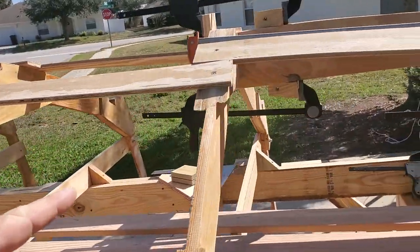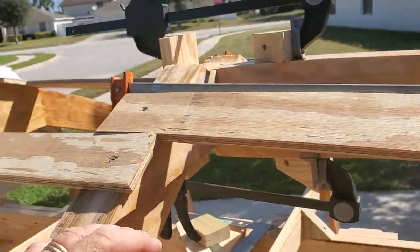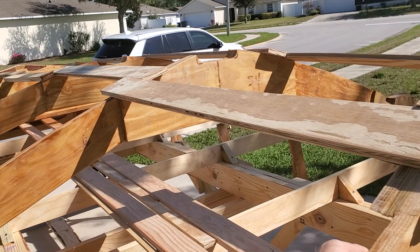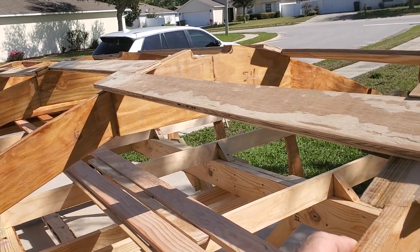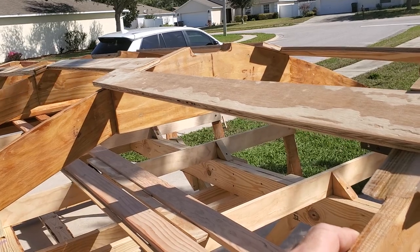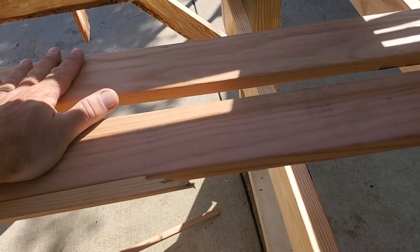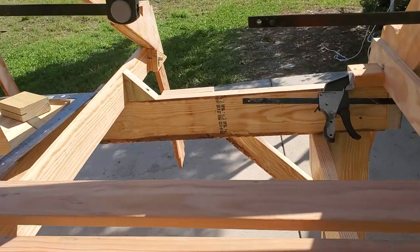I'll glue one down, make sure it's as even as possible touching all the frames, and then I'll laminate right on top of that with the second one-by-four. That'll make it, as opposed to putting just one two-by-four, an extremely strong laminated keelson. The guy that designed this boat knew what he was doing — I love it. It's a great concept: lightweight, strong, much stronger than just a single two-by-four.